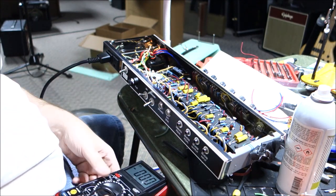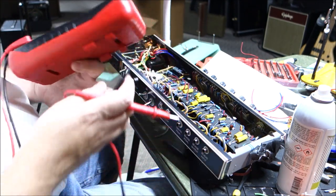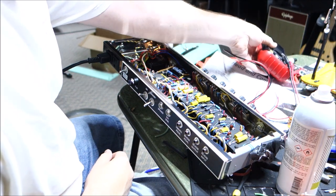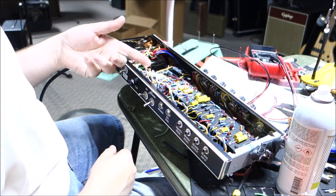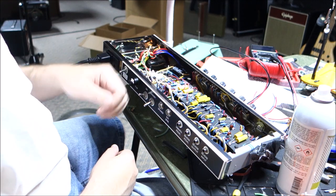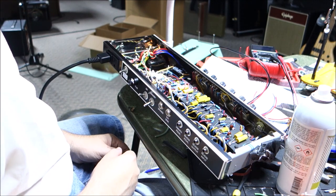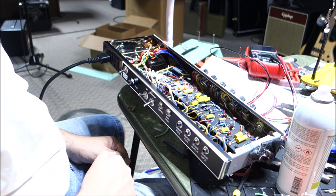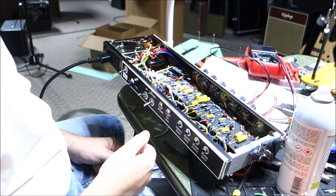All right, it's minus 36.5. So minus 36 is fine. Like I say, they're shooting for 40. They're shooting for 34 factory. And of course, we still might be on the hot side once we get everything measured. But so far, so good. Now we're going to add a rectifier tube and see if we get high voltage and sparks.